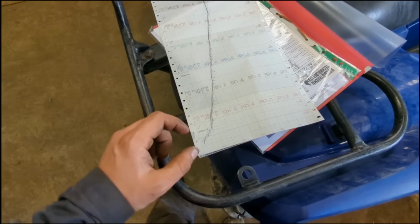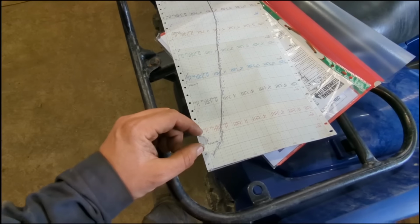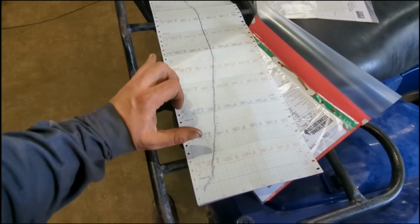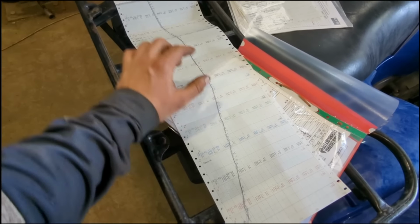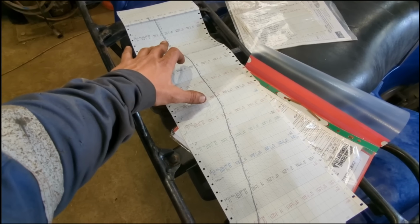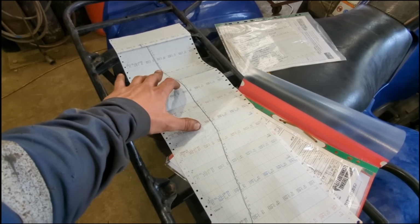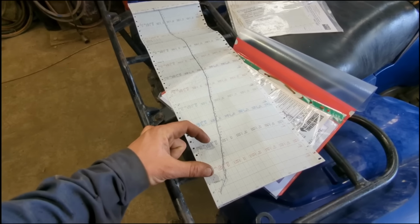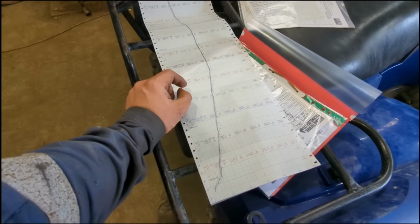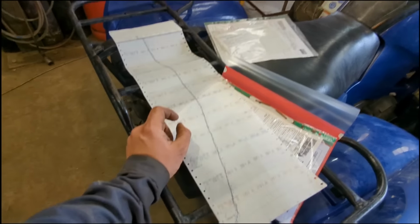Another very interesting thing to note is the curve up to temperature. 1, 2, 3, 4, 5 hours. Now the whole thing was not sitting at 600 degrees, it was just the weld area, and then the heat obviously graduates out into the rest of the casting. It's incredible to think approximately 5 hours to get that entire weld area up to 600 degrees.